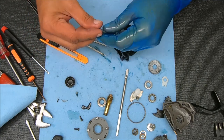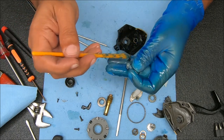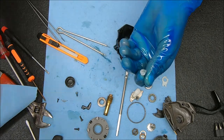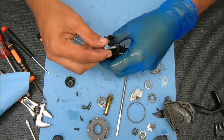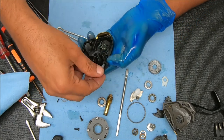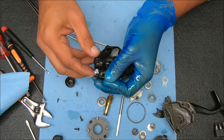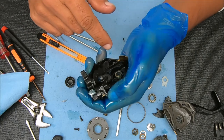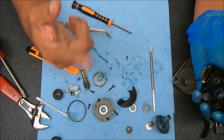Now for this piece, let's go ahead and grease it up a little bit. I didn't remove that little silver bushing on top there — note that there is one there, so if you don't have one it has to go on. I'm going to rest this in the hole right here, then drop that straight through with the larger hole facing up. We're not going to put this in all the way. My apologies — I thought I was recording and I wasn't, then I went through this entire thing and you guys didn't see it.